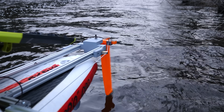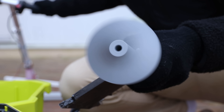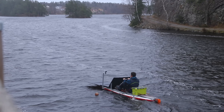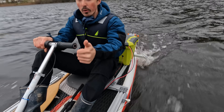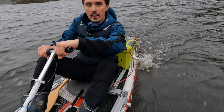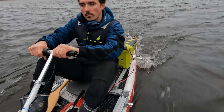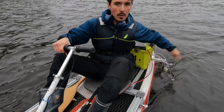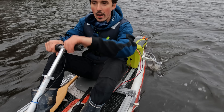I printed a significantly longer arm and now the rudder turns a lot more. I also made a new propeller that's a bit smaller as the motor was getting quite hot, and I shortened it so it would hopefully be more balanced. The electric speed controller was also getting quite hot, so I added a 12-volt water pump. The steering arm is a lot longer so I have significantly more steering, which is perfect. I added a water pump I can turn on and off — water is pouring out here. The pump circulates water through the ESC and cools it down, which is perfect since the water is icy cold.